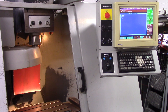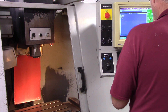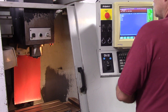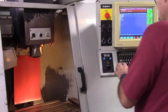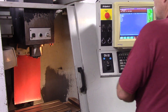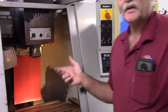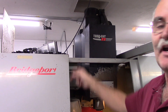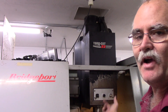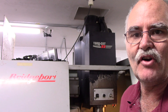You can't see it but the carousel is turning. We'll go one more — M6T22. And then we'll go back to T1. The machine is set up for BT40, but up here on the top I've got a brand new carousel full of Cat 40 fingers. It just so happens that the spindle nose uses the same pull studs as Haas, so it wouldn't be much to switch it over to Cat 40 if you wanted to.